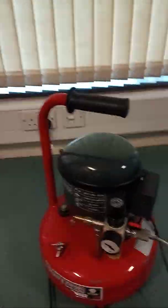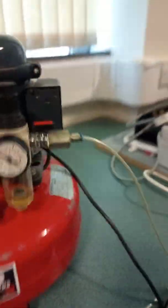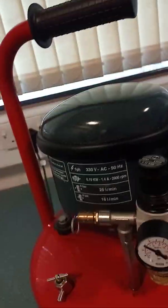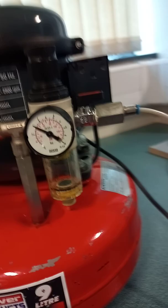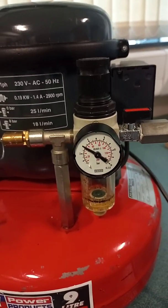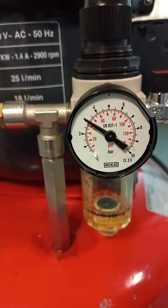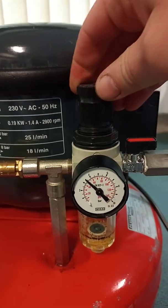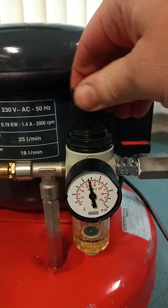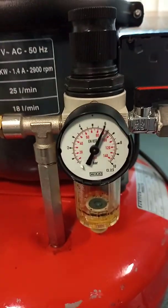The compressor — we have to carry out certain maintenance tasks on it. You can check to see if we are at system pressure. The manual told me this system should run at 6 bar. Currently our compressor is at 3 bar, so I can adjust that up to 6 bar. The system is now set at 6 bar.